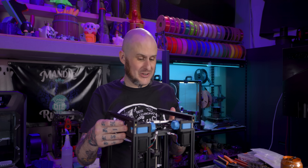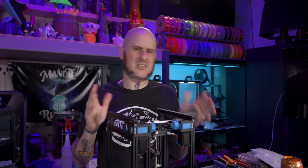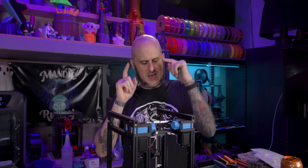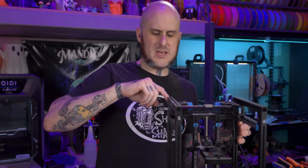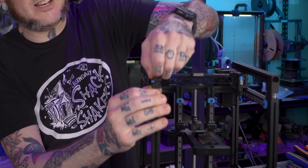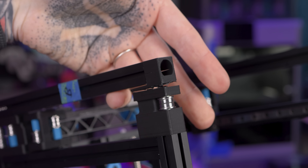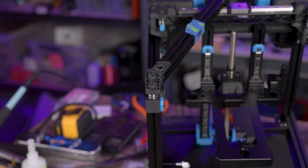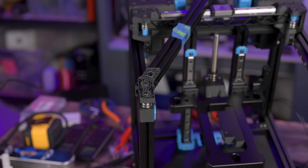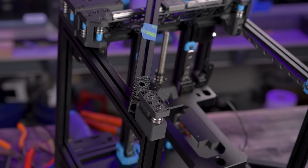Overall I've been impressed with the quality of the prints, but I have run into a few that aren't perfect — overhangs being a little funky, which is partly a design issue with the 0.2. But I just had a major delamination and I have to stop and reprint this part. This front corner, when I put the B extrusion — the part that goes above the gantry — on it, pulled the two ends together and just completely delaminated. Having slept on it, I realize I 100% cannot recommend buying this kit with printed parts. Looking closer at the failed component, it only has two walls and maybe 10 to 15% infill, which is way outside of Voron spec.